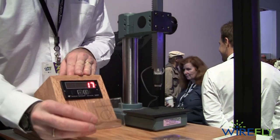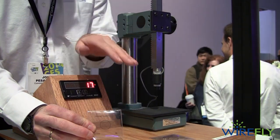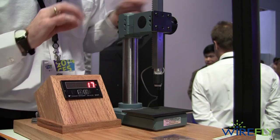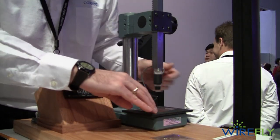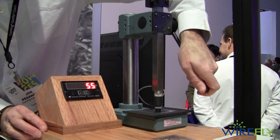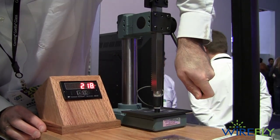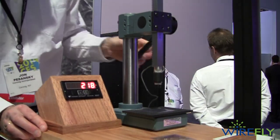Now we have a piece of 0.4 millimeter Gorilla Glass 3 with the same loaded scratch. At 0.4 millimeters, we're half as thick as the alternative aluminum silicate and four times thinner than the soda-lime sample. We put this sample into the press and load it up — we're well past both the soda-lime and the aluminum silicate. We can take this sample well over 200 pounds. You can see the deflection, the way that glass is flexing with that scratch in it, and it still will not break.